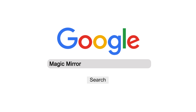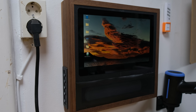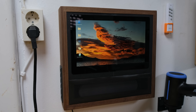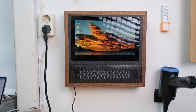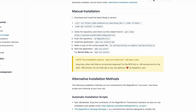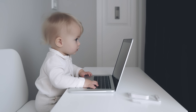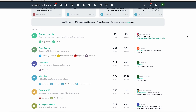It's up on the wall but right now there's nothing on it, so the next part is installing the Magic Mirror and doing some programming. Magic Mirror is most often used with a display and a one-way mirror in front, but I'd rather see other information and interact with the touch screen. You can download the entire software onto a Raspberry Pi running Raspberry OS and follow the guide on their website — it's quite straightforward even without experience. Once installed you'll see modules showing weather, calendar, and news, but I wanted to customize further. There's a big community around Magic Mirror with lots of downloadable custom modules.